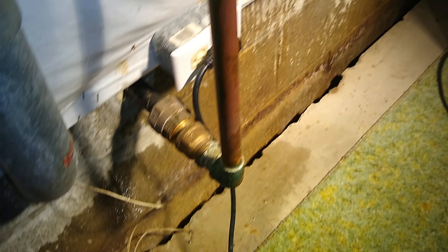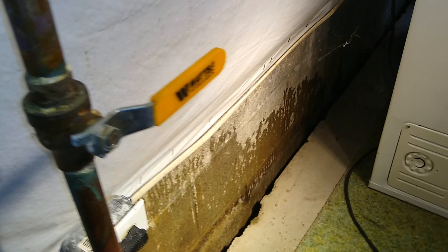I didn't get a good picture of it like that, but I did a quick Photoshop to show what that looks like. This area on the back wall is under the back deck. The soil grade under the deck drops a good 8 inches as it gets closer to the foundation. That will need to be re-graded next summer to see if that's all it needs.